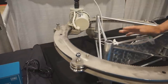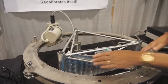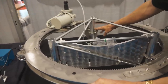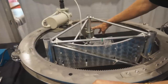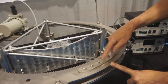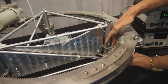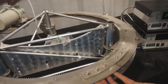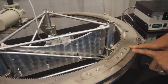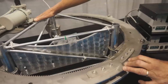To set this rotator up is a piece of cake. You mount the plates on the tower legs first, take a level and level them, then bring up the rings — which are split one half at a time. Set the rings onto the plates that hold the ring to the plate, then bring up the second ring, set it to its mounting plate, and bolt the splices together on both sides of the rotator. The last thing you do is bring up the motor and bolt it into place.